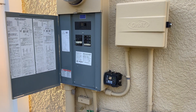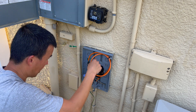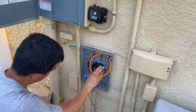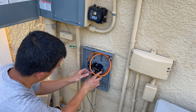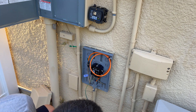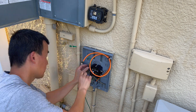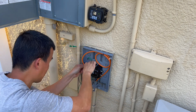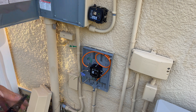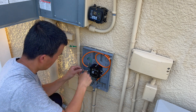Now we've got it back all together. I'm going to go ahead and put the cable surge protector down at the bottom here into the cable box. Pretty much just find the two spots — the input is right here and the output is on top, so you can turn it however you need. I'll put the input on one side and the output on the other. Go ahead and screw it in, then cut the ground wire and ground it through this bus right here that's also chassis-grounded to the main ground of the building. Strip the wire back and ground it right there.